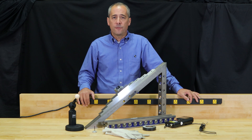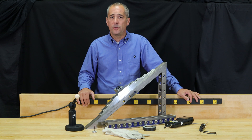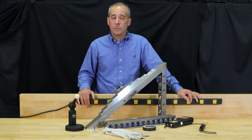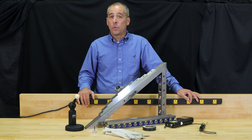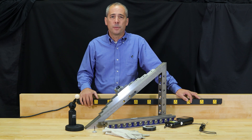Preventative maintenance is definitely recommended on an annual basis. It is performed by a trained, qualified factory technician and will include tuning of your CNC drives, tuning of a scanning probe if you have one, adjustments to joysticks if they begin to drift, adjusting air bearings, as well as checking cables and harnesses to make sure nothing's coming unplugged, and voltage checks. There's quite a bit that goes on in preventative maintenance, but it's definitely worth it — it prevents service calls midway through the year.